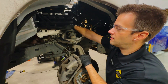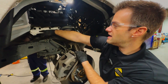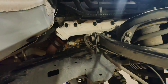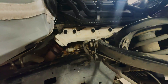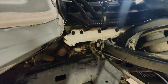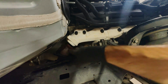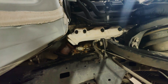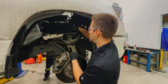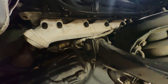The biggest difference between the DT series new body style and the DS body trucks is the outlet angle. Some folks have attempted to put the old style manifold on these newer trucks and it bolts in, but then the exhaust doesn't line up at all — that's the biggest difference between these manifolds and the prior body style. We've got it all lined up nicely. The other side is being tied up right now, but we'll get the heat shield on and make sure it all fits nice with the exhaust pulled on.